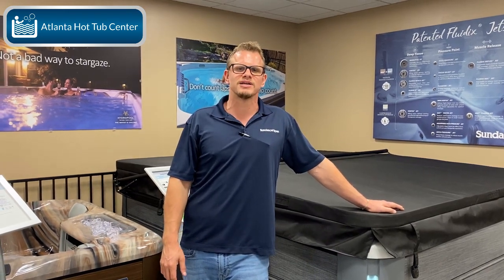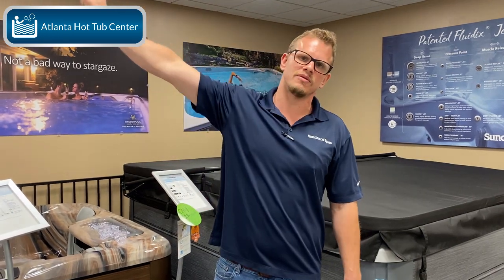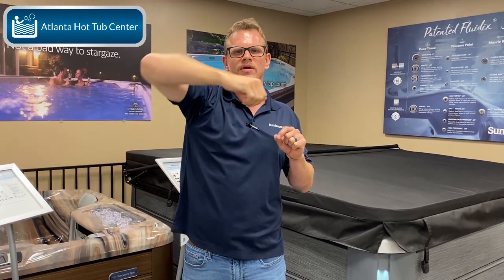Again, I'm not telling you how to do it — just giving you an outline. You need to refer to your electrician to make sure you are following all the electrical codes. So: you've got a 60 amp service in your main panel inside your home. That is a non-GFCI 60 amp 220 breaker. You're going to run 6-3 with ground — that is two number six hots, a number six neutral, and a 10 gauge copper ground. You can buy all this at Home Depot or Lowe's. You'll run that out through the main panel — whether that's in your garage, laundry room, or basement — up through the ceiling and out to your sub panel.